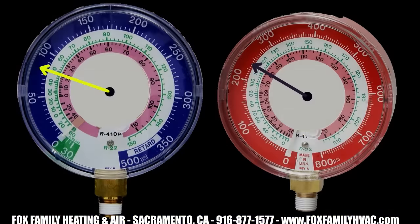How long does it take for refrigerant to cycle through a typical residential split system? I'd say about 3 or 4 minutes — let me know in the comments if you have a different answer. We can see that the low side has come up to about 27 degrees or 92 psi, but our evaporator coil is still freezing. Let's add 2 more pounds and wait. I know there's a lot of pressure on techs to get calls done quickly, but it's essential to let the system stabilize before adding too much refrigerant. If you add too much too soon, you could see pressures skyrocket insanely fast, and then you'd have to recover refrigerant into a separate tank, which takes even more time.